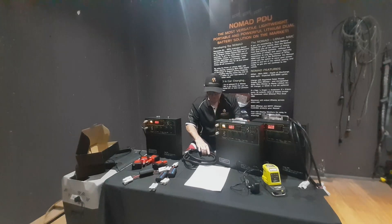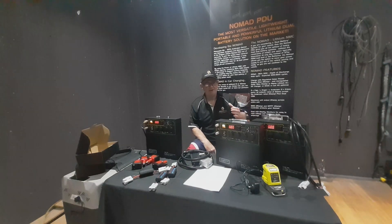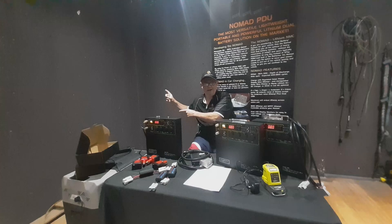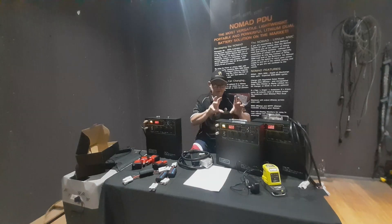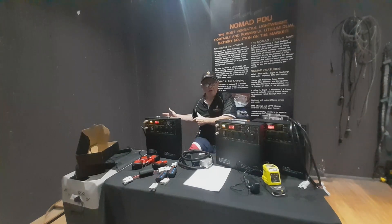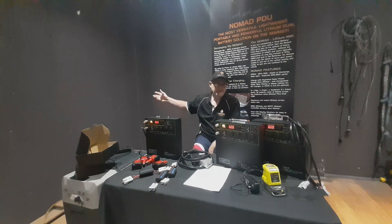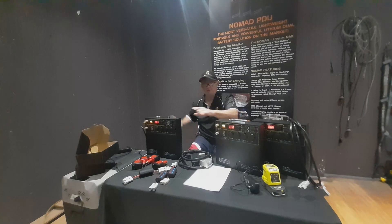To go over that again: a maximum of 25 amps at any given time can go into the Nomad. You can split that — up to 10 amps here and up to 15 amps there — but it cannot exceed 25 amps by even half an amp, or the unit will trip and need to be reset by drawing more than an amp out. The Ciga DC chargers have been very popular and cover most scenarios. An unregulated solar panel without its own regulator can be connected to the red and black poles, and the Nomad's internal regulator will charge at 10 amps specifically for lithium. If your panel's regulator only has lead-acid, AGM, and gel settings, put it on gel and plug into the regulated input, or switch to the lithium profile if available.